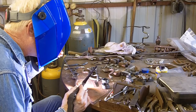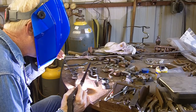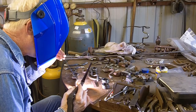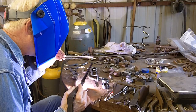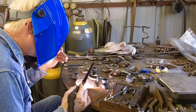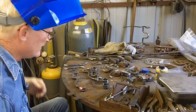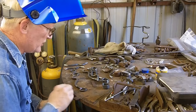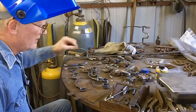I'm just working my bead right around. I welded the seam up on the ring, and now I'm joining the ring to the bottom of the shank. I've just learned to slow down a little bit and run a nice bead instead of getting it too hot. I've got this side tacked and I'll let that cool for just a minute, then wire brush it. I'll flip that over and wire brush the other side.